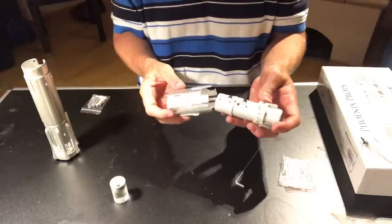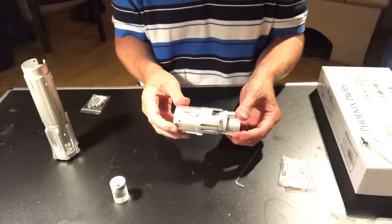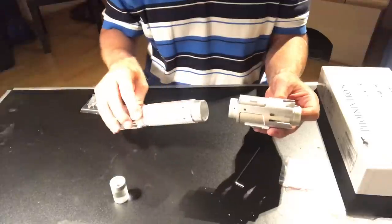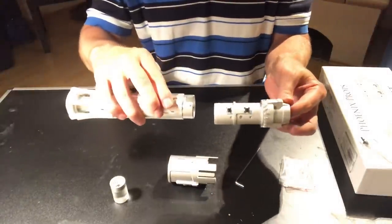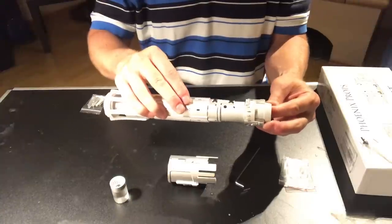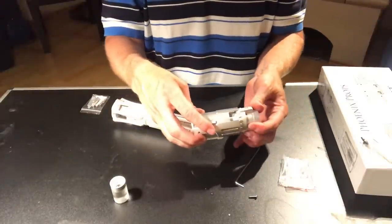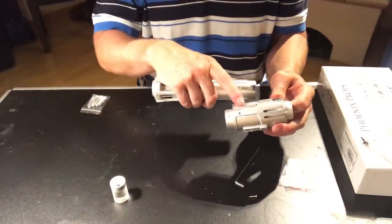Now the next step — we're going to slide our shroud over. You're going to see this isn't centered where the switches are — it's actually offset. Very easily, just put these together nice and neat. Now take your base again. There is a cutout in this part — you can't make a mistake, it's keyed — and this cutout fits with the switch block. There is only one way that this piece fits together, and that is the correct way. There's a little bit of slack — that's part of the design. The holes and the screws will make sure that these pieces make perfect alignment. Take this back apart, put the piece over — now you know that this key is going to be right in line with the pill cage and the pill. Put it right in.